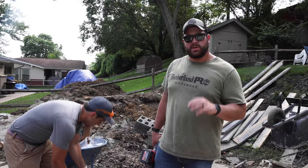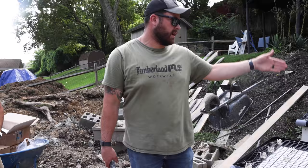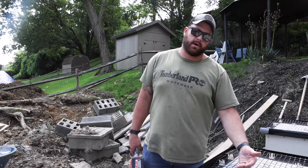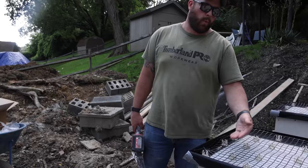So we're ready for the pour. Everything is sealed up with duct tape and any of the gaps. We got all the corners pinched together. Jordan got all the fiber laid in there with the Z-form clip and the mesh, which is a really cool product. If you were to do this without that part, you'd have to put either rebar or wire mesh in there while you're pouring. Make sure it's up in the middle of your concrete.